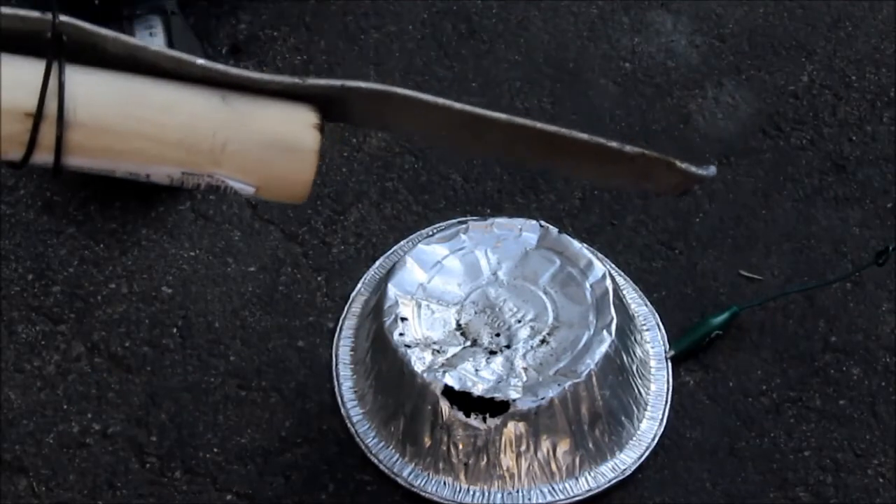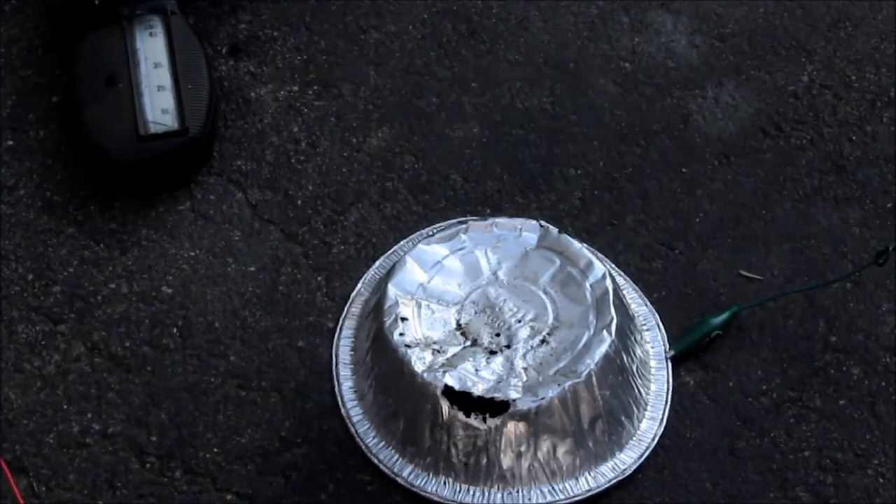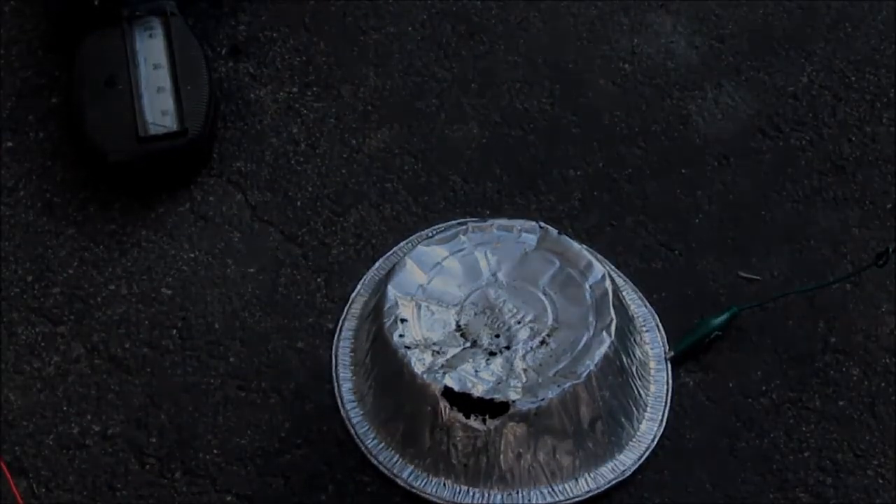Wow, that lasted quite a long time, and that was only limited to 30 or 35 amps somewhere between there, compared with unballasted 45 amps which only lasts for a handful of those arcs before it pops out. I'm impressed.